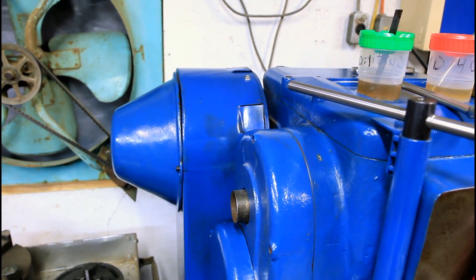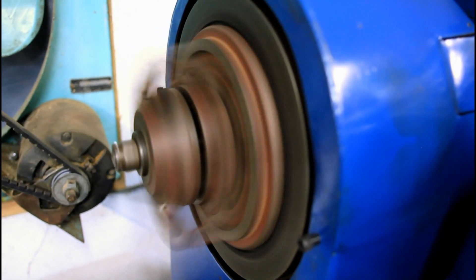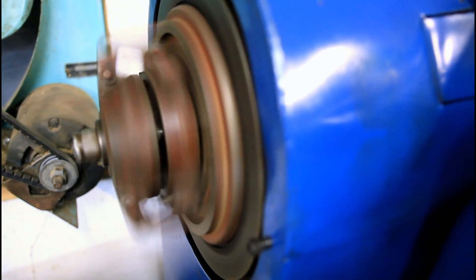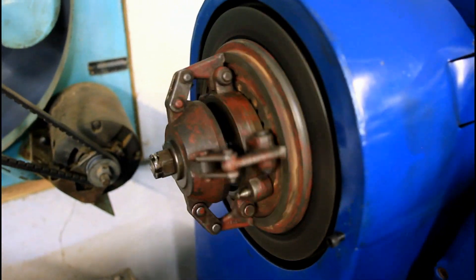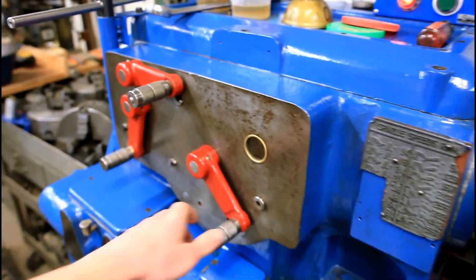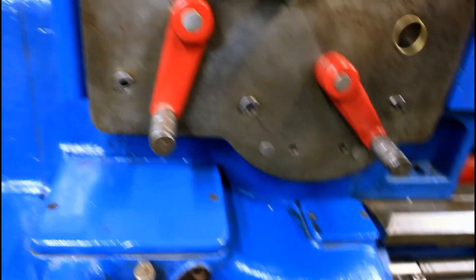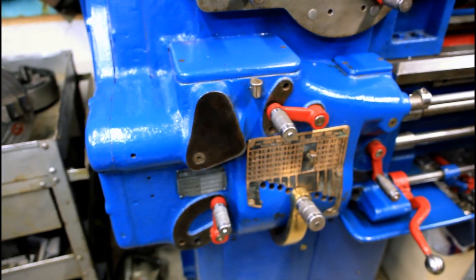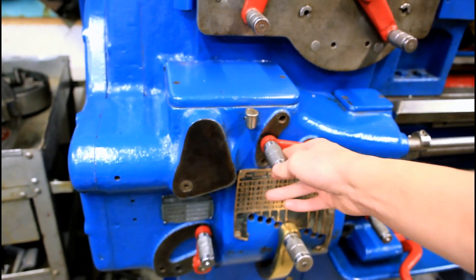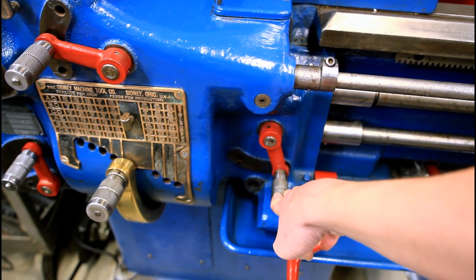The power comes in through a clutch — you just kind of pull it. It gives real good modulation; you can really set it to what you want it to be. Then you've got your standard array of headstock gears. It's got this really beefy feed box — real heavy duty. Pretty much your standard high-low range here. This is your intermediate adjuster; each notch doubles it. And then you've got your tumbler, with a lever for threads and feeds.